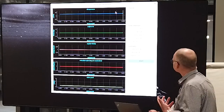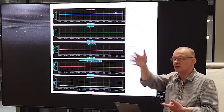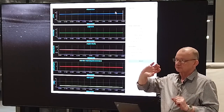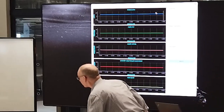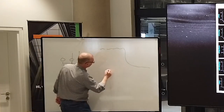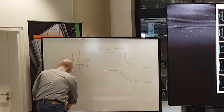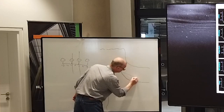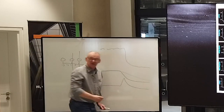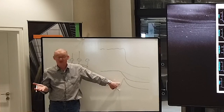A couple of quick things, if I may. One is somebody asked me about going around a wall, around a post. It will take me too long to find the slides, I can show you separately, but if you use that low pass filter, you've got some data, and there's your wall gone. If you have a reasonably fast low pass filter and a very slow low pass filter on the same data, and you subtract one from the other, you'll get nothing here, boop, and you've found the edge. And it's cost you almost nothing, just these two filters, one of which you were going to use anyway.